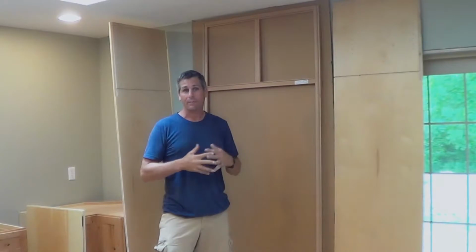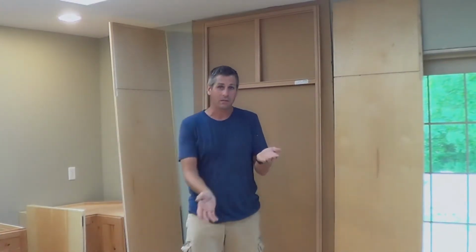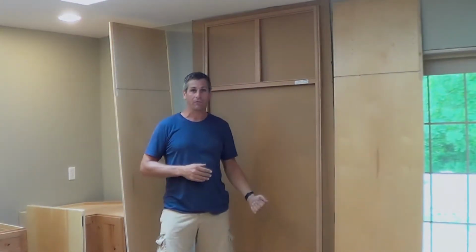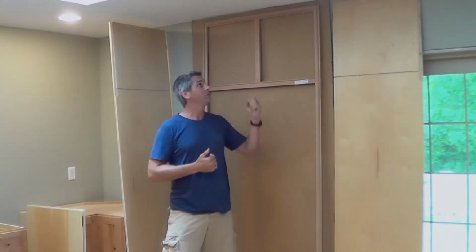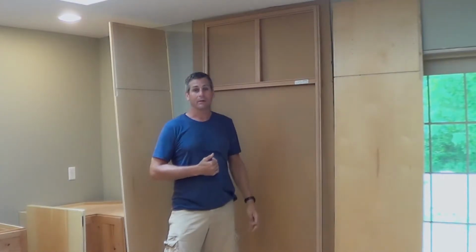You can't. In the case of tall cabinets, like the utility cabinets, we have a removable toe box option, which allows the cabinet to be built, then stood up, pushed to the ceiling, and the removable toe box slid underneath it. Works great, but in the case of a refrigerator cabinet where the side panels go all the way to the floor and there is no removable toe, you have to build the cabinet upright if the cabinet is only 2 or 3 inches less than the ceiling height.